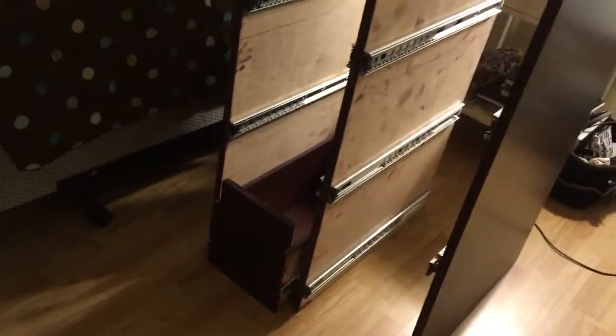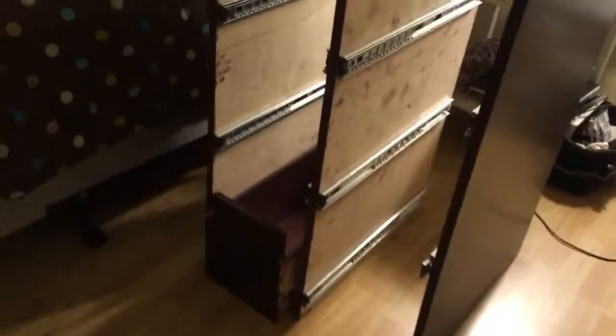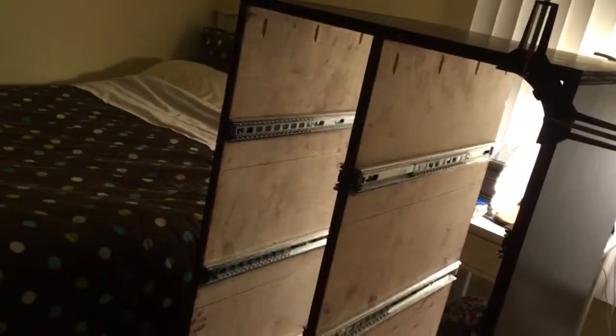I have to attach one piece to the bottom once I test my clearance — I want to make sure the drawers are coming in and out properly. Then I'll attach the bottom and leave it as is until I get the rest of the drawers in. Then I'll put the back on, but I want to make sure the drawers work first because I'd have to remove the back to adjust any sliders and I don't want to do that.